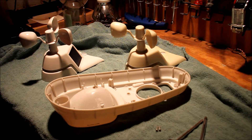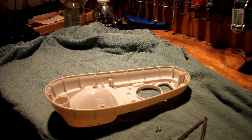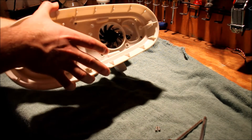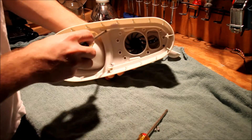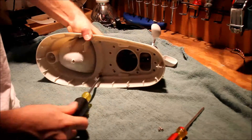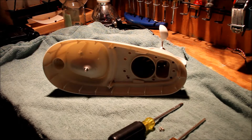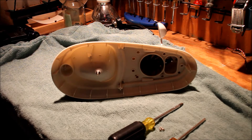And we're back. At this point we are now ready to begin assembling again. I'm going to set the old unit aside — I don't think we'll really be able to use that in the future, but I may keep it just for parts. The new unit goes on the same way it came off — align the screw holes and begin screwing it on. Now all the screws are in. Don't make them particularly tight; they're only plastic threads, so it'll strip if you put it too tight — just firm enough that it's not going to move at all.